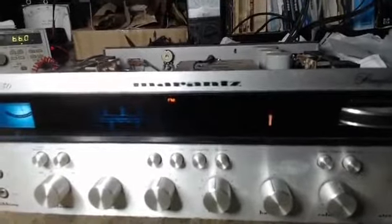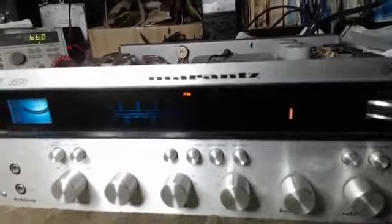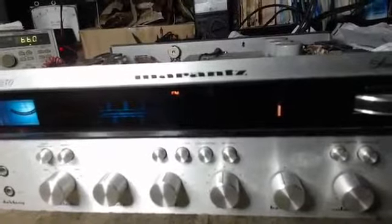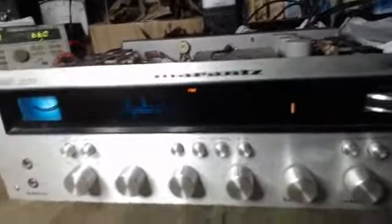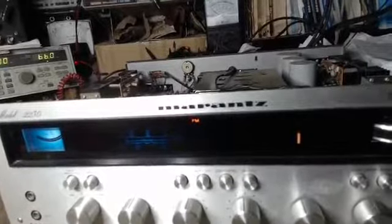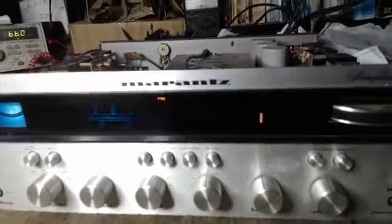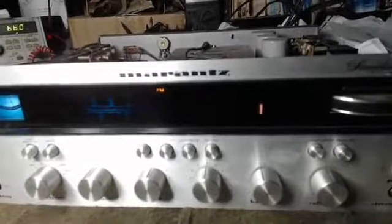That to me is extremely troubling because that just doesn't happen. That was the first indicator that this was tampered with. Number two, when I was doing the FM measurements, the left channel in mono, first of all, both channels should be equal in mono, but the right channel is down approximately 10 dB from the left channel.